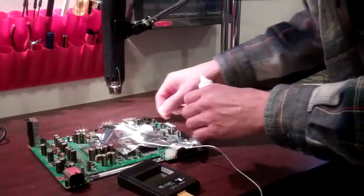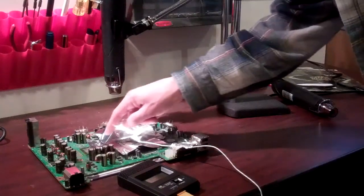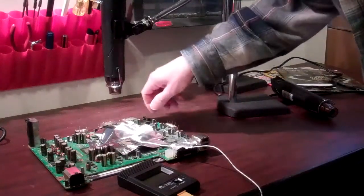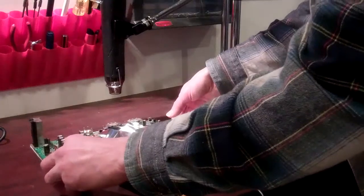Use a dry paper towel to clean up any excess flux. Then cut your tape — you should have received 12 inches of aluminum tape. Cut your tape into four pieces. Two shorter ones go down first, followed by the two longer ones, so that your GPU is completely boxed out, so that the rest of the board is not receiving too much heat.